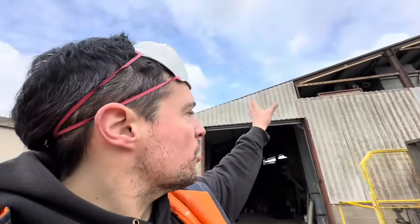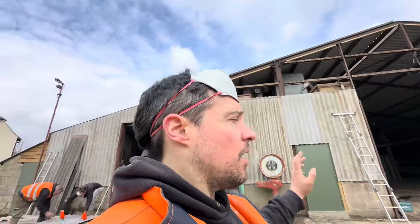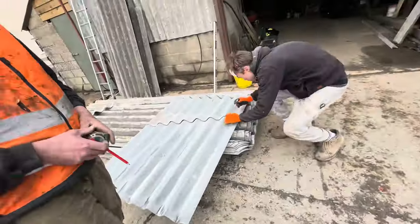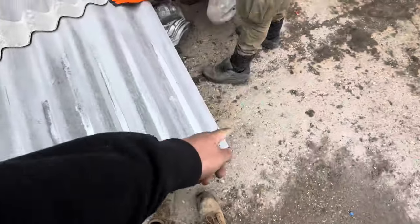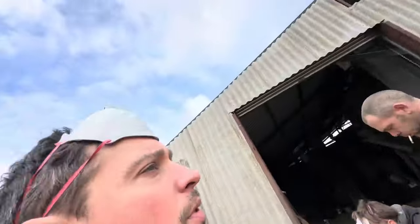So guys, now we have to move on to the top. We've got to start going on the top now, so that when we get to the other side of the door, where we line up with the ribs, what that means is we've got two cuts to do. We've got the angled cut at the top, and then also the corner cut, so that when you get a four board join, it doesn't sit out and leave an air gap.